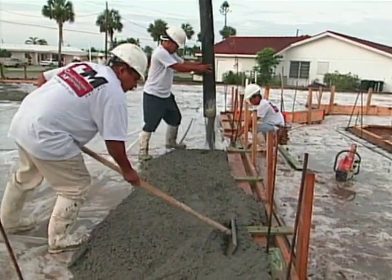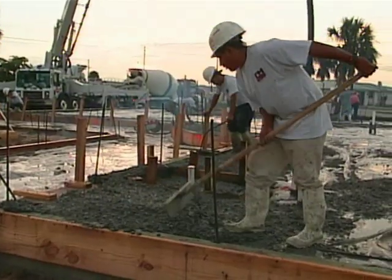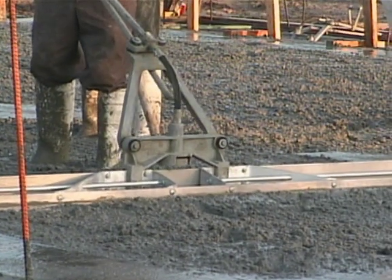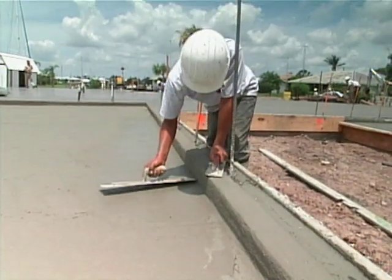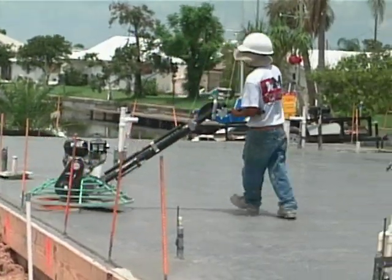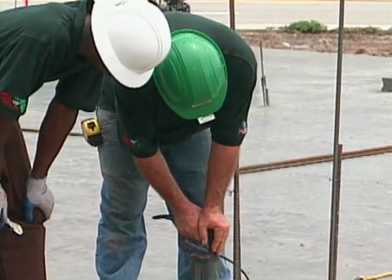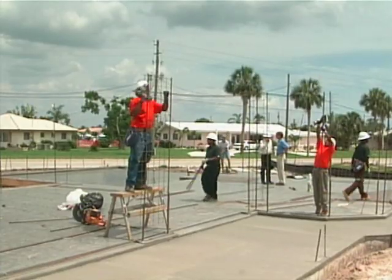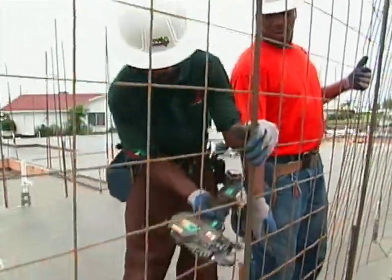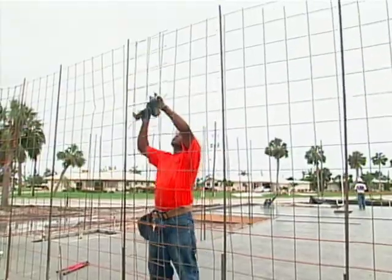This means going down about three courses of concrete blocks to create a barrier to storm surge waters, preventing them from getting underneath a slab and creating the hydrostatic pressure which could move the slab and destroy the house. All the concrete was delivered via a big pumping rig, making it easy to move the concrete around the whole footprint of the house to minimize labor. The reinforcing is very important to the strength of the slab — we have to make sure they're lifting it so it floats in the middle. Once pouring is done, the finishing begins using bull floats and motorized floats. The solid wall system itself requires vertical rebar — usually number fives — horizontal pieces for heading off window openings, and all of it is covered in a steel mesh reinforcing.